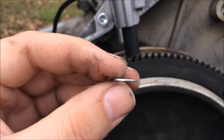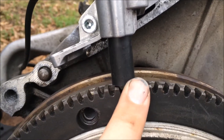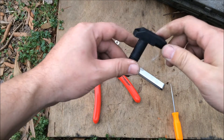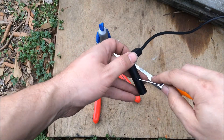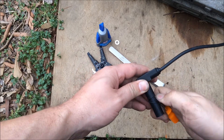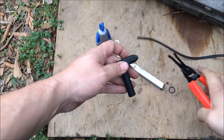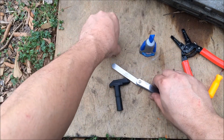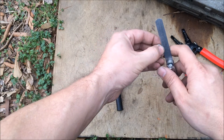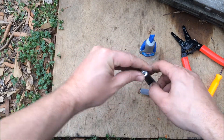So what we're going to do here is take a washer that is 0.8 millimeters and glue it on the bottom of the sensor so that way we can use this to gap our reference sensors with the bell housing on. I've got this old sensor here — it doesn't work anymore — so what I thought I would do was turn it into a tool so that way I could perfectly get my sensors every time. I won't be needing this rubber o-ring, so I'm going to go ahead and get it off. Next I am going to cut the lead off. And I've got some super glue here because I have found a washer that is 0.8 millimeters, and what I'm going to do is glue it to the tip of my sensor here.